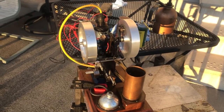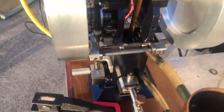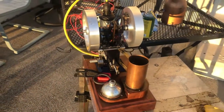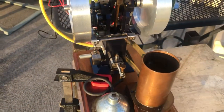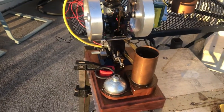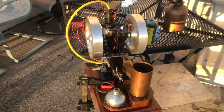I also believe he designed this engine to be entirely machined out of cold rolled steel, whereas this one has been made out of aluminum — which I believe a lot of people do. It obviously has a cast-iron sleeve in it, and it actually has a water jacket, but I don't put any water in it. It doesn't even get hot.